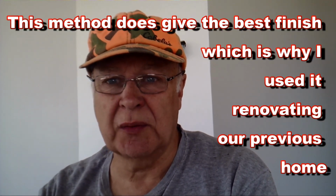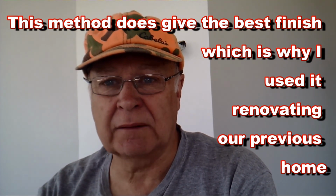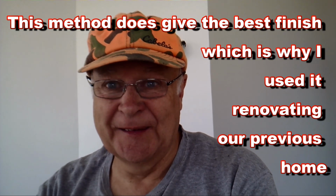You've got two choices. One is to leave the original skirting boards in place and lay up to them, leaving that gap, and then to add a cover strip over the top. Your second option with a renovation is to remove all the skirting boards and the architraves, to lay the floor up to the wall exactly the same as you do with a new build, and then put your architraves and skirting boards back on. That's a lot of work.